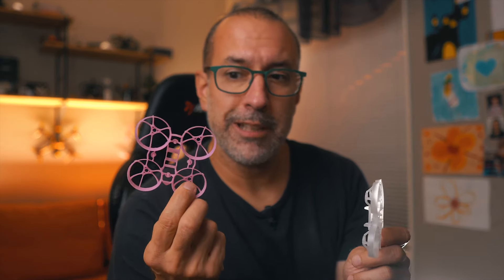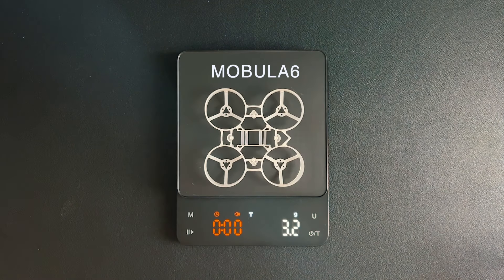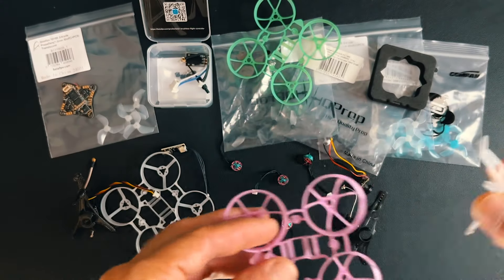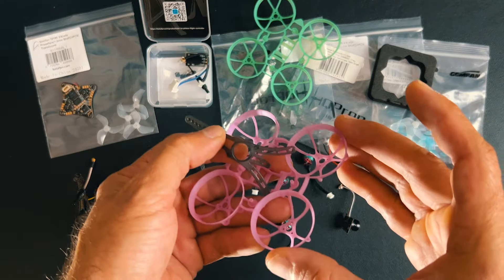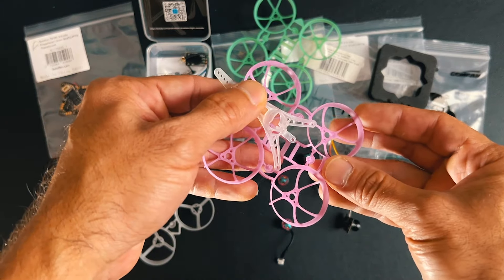I'm gonna need a frame — a light frame — since I'm trying to keep as close to 20 grams as possible. I have the Mobula 6 frame here and I also have a BetaFPV airframe. Which one to use will depend on the weight. The Happy Model frame is 3.2 grams while the BetaFPV airframe is 2.5 grams, which means I'm going to be using the BetaFPV frame. For the canopy I have one from the Mobula 6 2024 and one from the Air 65 from BetaFPV. They are pretty similar and both fit the camera I'm gonna use perfectly. The weight is actually the same for both, so I'm choosing the BetaFPV just because of the color — I think it's gonna look better with the frame I've chosen.